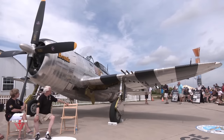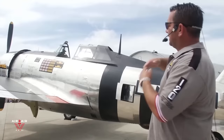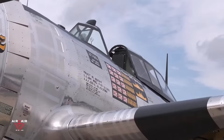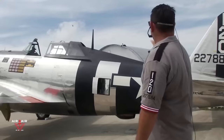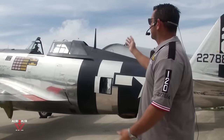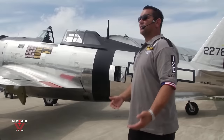One of the things about this particular airplane, and we spoke about it when we were talking about Thunderbird, having the high deck, the turtle deck, puts the air back together coming off of the canopy, and that's a huge amount of drag. There's a gigantic low pressure from that air going over the top of the canopy. So having this high back puts that back together, makes it more efficient, makes it faster. However, you got all these bars and stuff in your way to be able to see. So you can see why they went to the bubble style canopy on all the fighters to just give them the ability to be able to see the enemy.